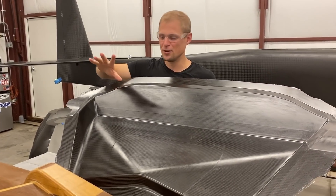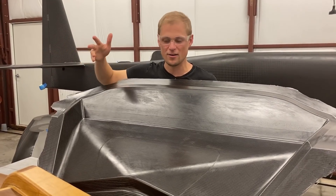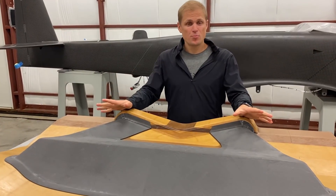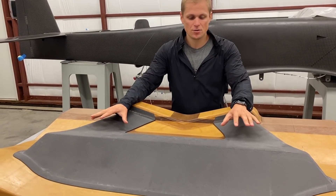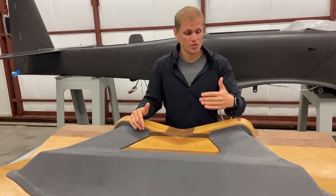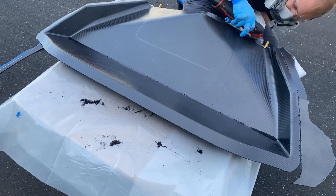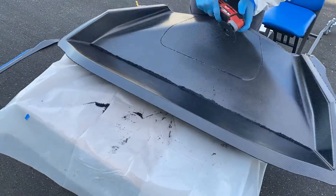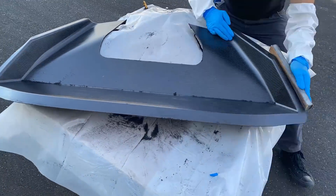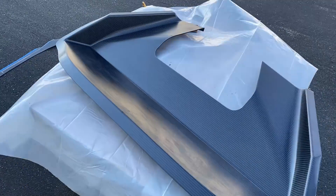Really, this is a little bit bigger than anyone should ever go with an MDF mold. I wouldn't recommend trying to, say, build a wing on an aircraft with an MDF mold, but we got away with it for this part. Here's the finished part — we threw it back on the mold just to get an idea of how it interfaces with the mold. When we trimmed this up, the process was pretty simple: we used an oscillating cutter and did a rough cut all the way around the perimeter. We had a feature molded into the part as a reference so we knew where the edge of the part was and how far to trim. After the rough cut, we used sanding blocks to true up the edges fine-tuned right to where the part should be.